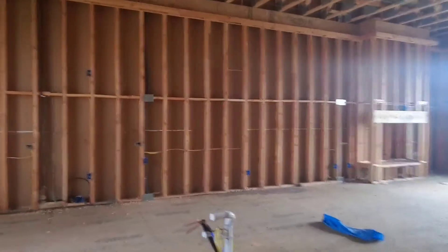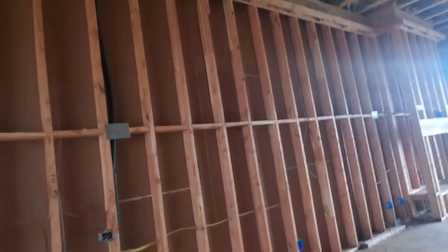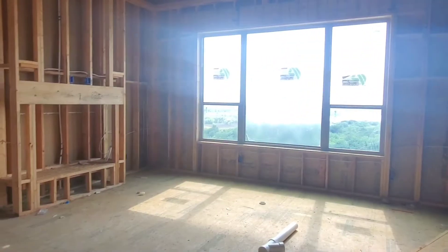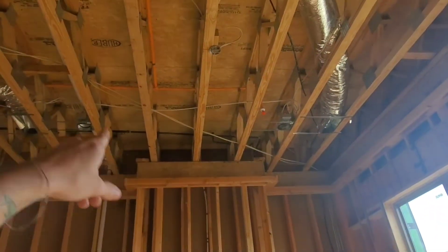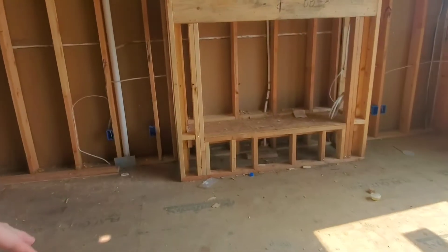Now the fourth floor. Up here we are wired for two TVs. There's one here — actually no, there's no TV in these kitchens. That one is for the fridge, and the microwave is going to go above it. It should be 7.1 wired in here, but looks like they haven't wired it yet. We're going to line 7.1 up with these cans — six speakers in the ceiling and one below the TV. We'd normally advise against this, but all our clients are looking for a super clean look on these modern custom homes. This one client may consider doing nine channels and putting a really sleek gloss white Martin Logan tower in here to get the front stage all in the front.